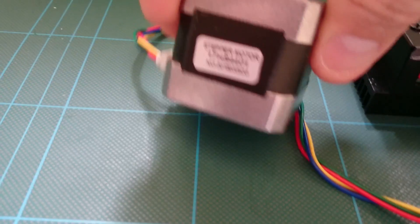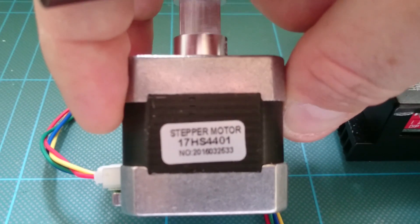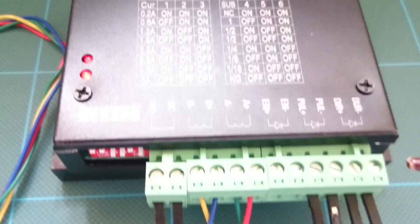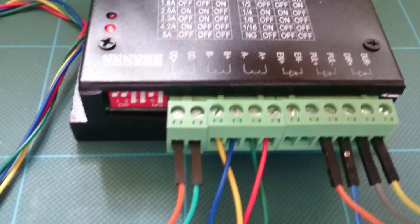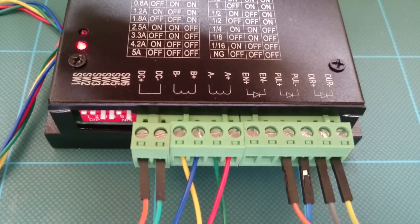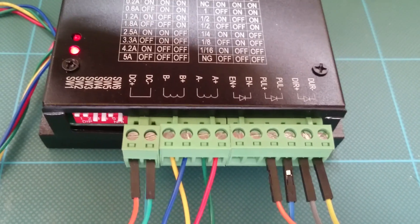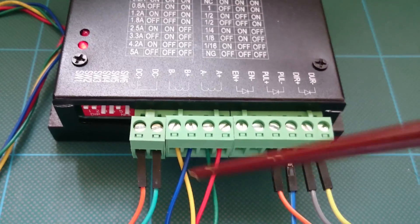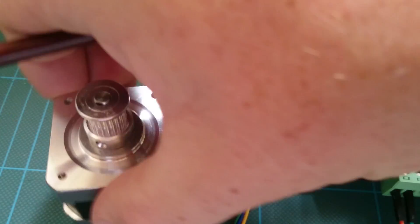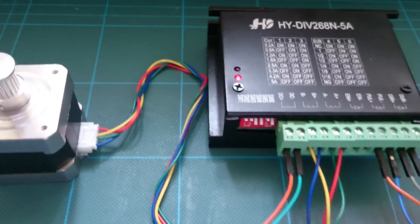The serial number on the motor is here, in case you have the same one. B minus is wired to the yellow on the motor, B plus to the blue, A minus to the green, and A plus to the red. This seems to be the new color code on the cheap Chinese NEMA motor — the yellow used to be black, and I'm not sure the wiring was the same for the coils.